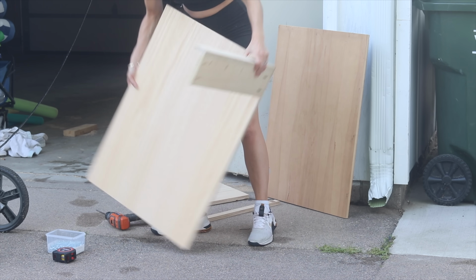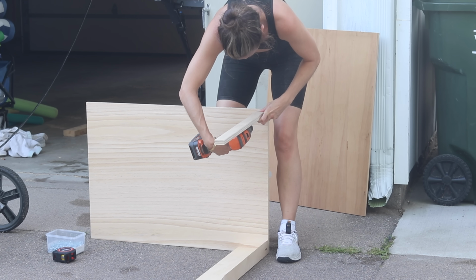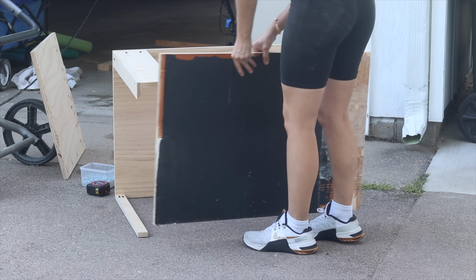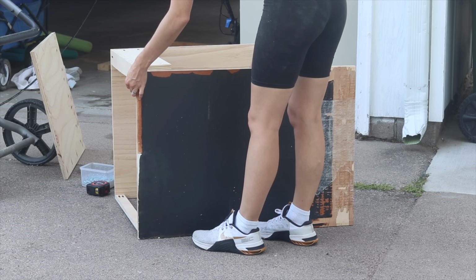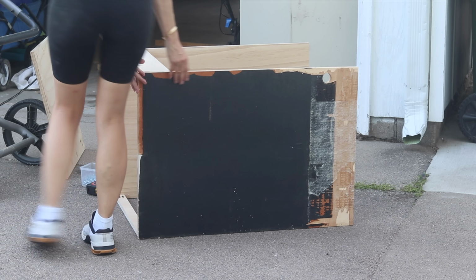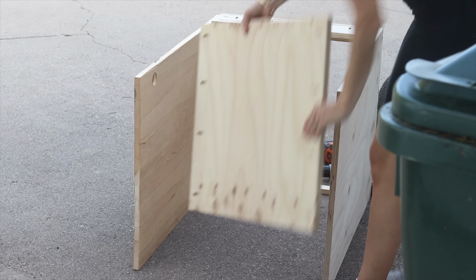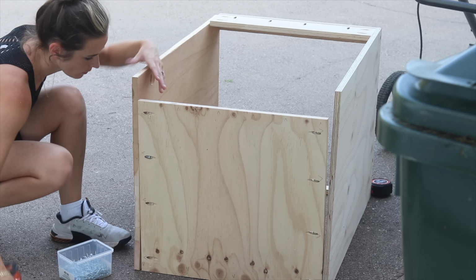I knew I wouldn't be standing in this corner needing space for a toe kick to work, so I figured I might as well build my own cabinet so I could drop my pullout down 4 inches and then have space for an additional drawer above the garbage pullout. So glad I did this, and I repurposed that piece of plywood that used to be by the fridge. I repurposed as much material as I could out of the original kitchen because I hate to throw things away.